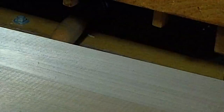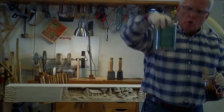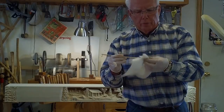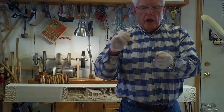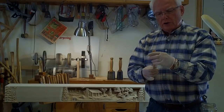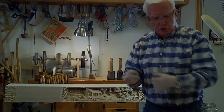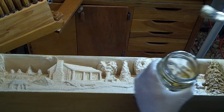I see we do have a little bit of saw marks going across, so I'm going to scrape the whole surface and then lightly touch it with sandpaper. I'm mixing mostly clear varnish with some of the Minwax golden oak stain. This is the small artist bristle brush for oil paints, and I took some burnt umber and put a little bit on a card to use as my palette, for putting some of the darker shadows in. That won't come until towards the end of varnishing the first coat. I use a disposable bristle brush for the varnish itself — you need a bristle brush because it has the surface tension to pull the varnish, where a nylon brush just slides right through; the nylon bristles are too smooth for varnishing.